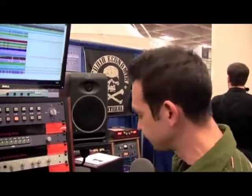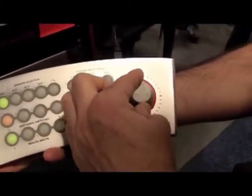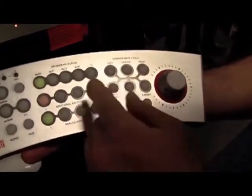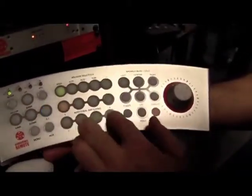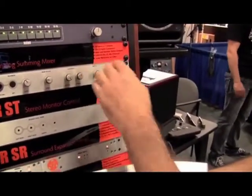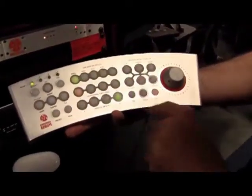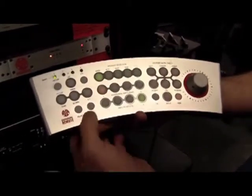Because of all the available modules, it offers lots of options for you. If we take a look at the remote, we have a volume control that is based on relays — you can hear the clicking. We have three sets of speakers available to choose, four inputs to choose. On input number four, we can manually use an offset so we can instantly create the same level on two sources. We have a talkback button, a dim control, mono, and an additional aux in.